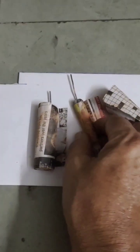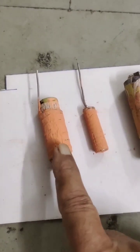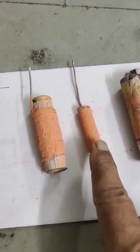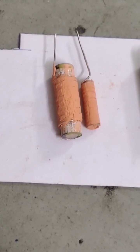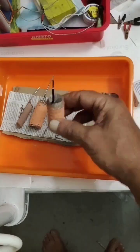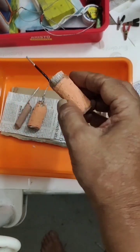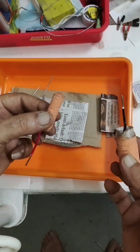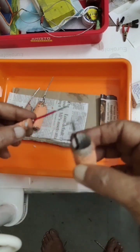60, 30, 50 gram spring shape grids prepared just for my another set. This cylinder will be our negative, this will be our positive, this will be in the center. This is our negative hollow cylinder shape negative electrode — the outer side is pasted with lead oxide and dried well. The center positive I paint red and the negative black.